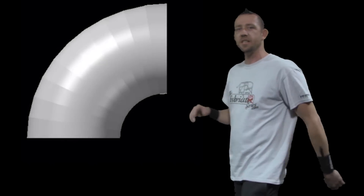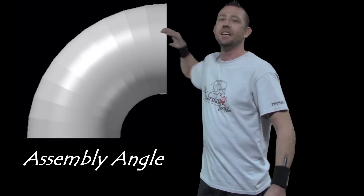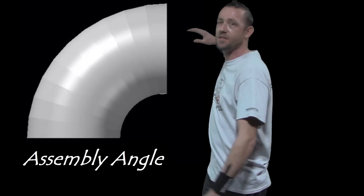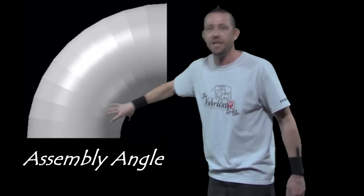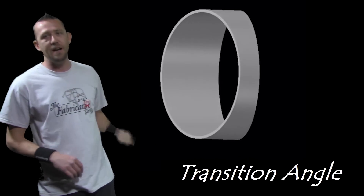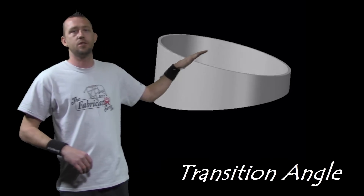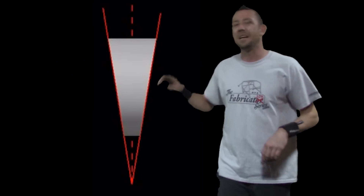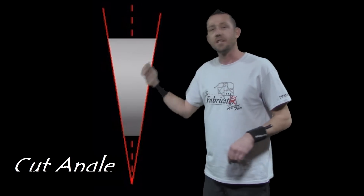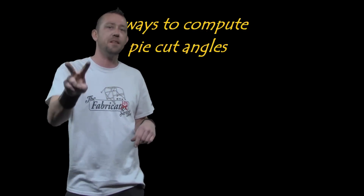What is the assembly angle? The assembly angle is all pieces of pie — every single piece of pie in the assembly — to create whatever angle it is that you are creating. In this case you're seeing a 90 degree angle. All of these pieces of pie to create this assembly of 90 degrees — that number is your assembly angle. Next, the transition angle: how much transition does one piece of pie provide? How much transition angle is added by one piece? That number you also need to know. Next, the cut angles — this cut and this cut — that is two cuts on each side of a piece of pie. You need to know the cut angles so that you can get the transition angle, so you can get the assembly angle.